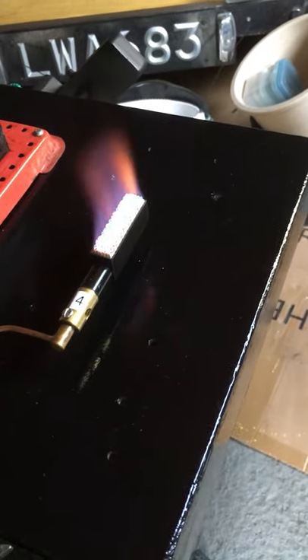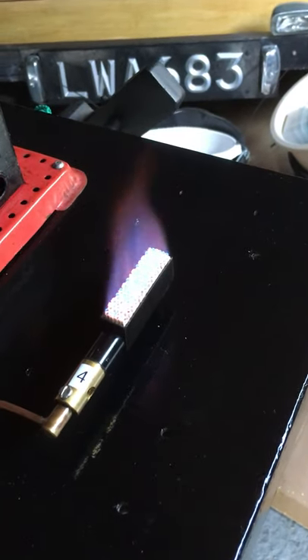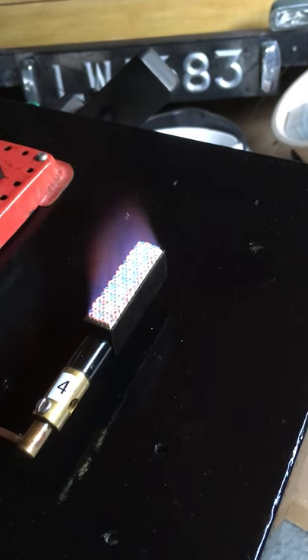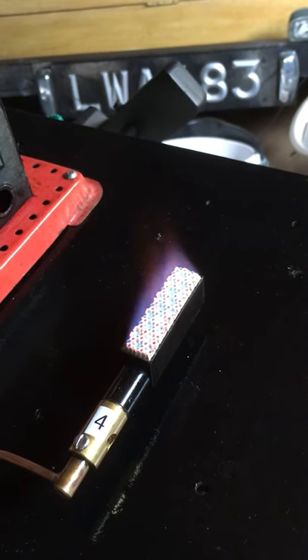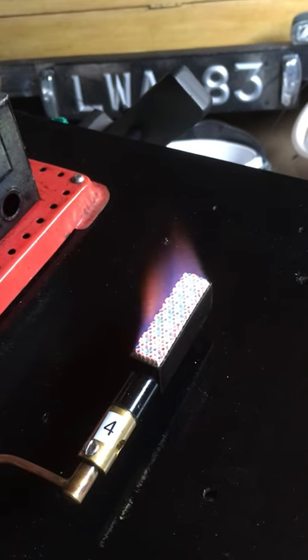This final little video I'm doing on the phone rather than the decent camera, just to talk through this gas conversion. Here's a little Bix burner which I bought from Forest Classics - absolutely superb little burners they are. You do need to tune them, which means you need to move the jet in and out of this burner to get the right air-to-gas mixture, which I've already done. There are videos on YouTube - just search for Bix burners.